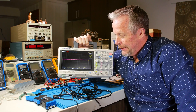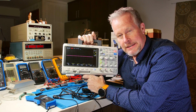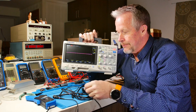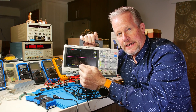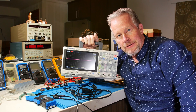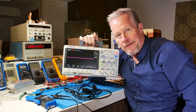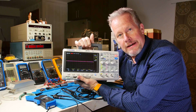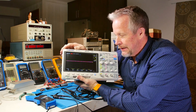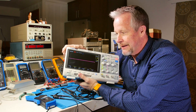That would probably look like a fuse. Be safe. Make sure that you have your scope tied correctly. They make differential probes and isolation probes to make it safer. Also make sure that if you're on the AC side of the power, you tie that to something that's referenced to earth ground. If you're not sure, turn off power, take an ohm meter, and ohm things out. That's the safe way to do it. Scopes are much more affordable now — you can get a very nice scope, something like this, for $450. You can get scopes under $300. You still don't want to lose $300 bucks, so be careful with your scope. Be careful with yourself and your circuits.